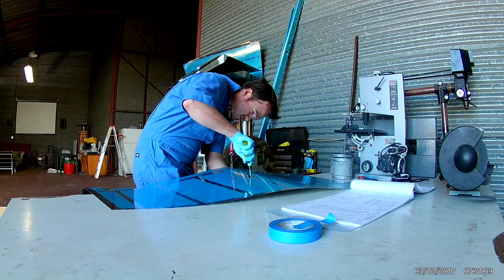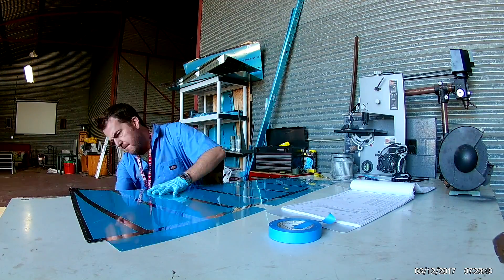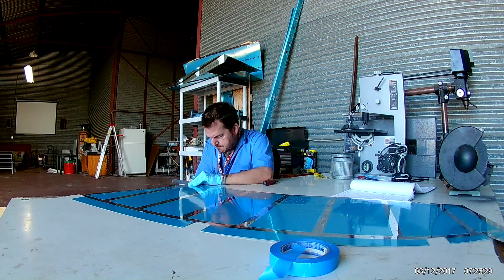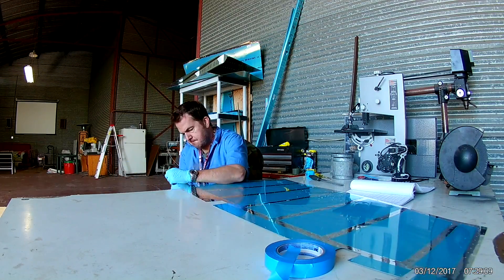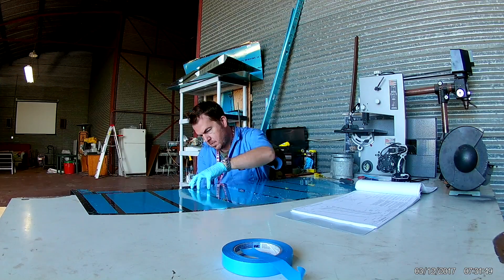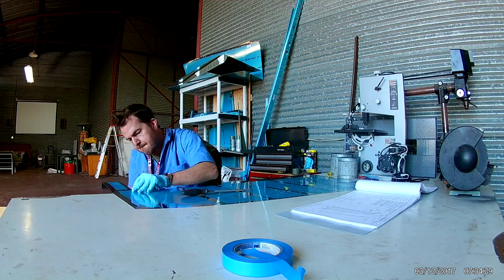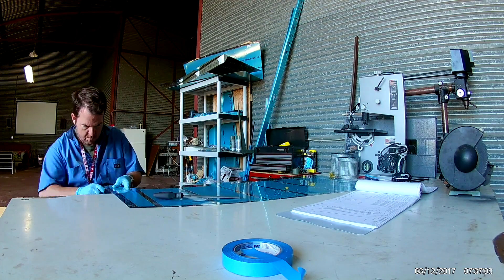Because the skin is thin, Vans warns to be very careful when you're cleaning. You do not want to over-deburr the holes and wind up enlarging the holes for the skin rivets. I would usually just use one turn. For big pieces of metal, or anything that's 24 thousandths or bigger, I would use two turns of my deburr tool. For this one, I only used one.